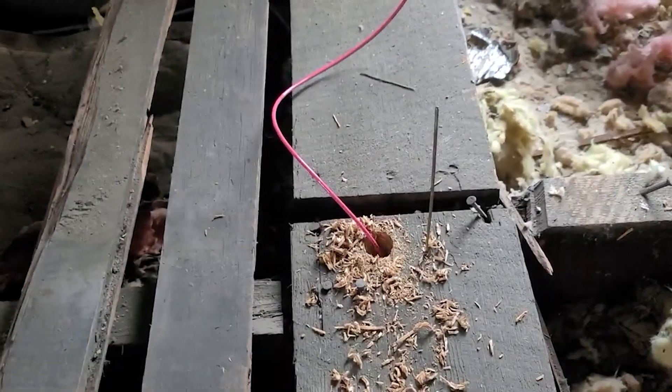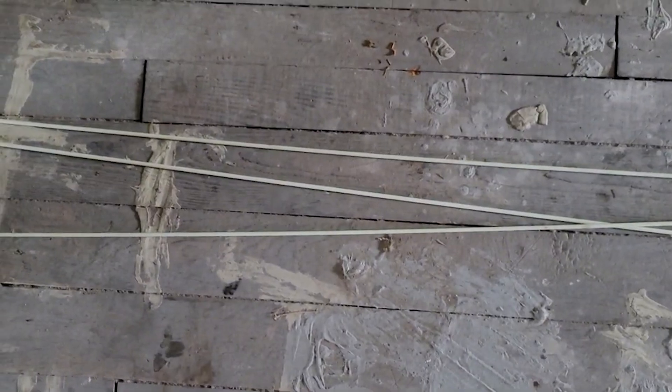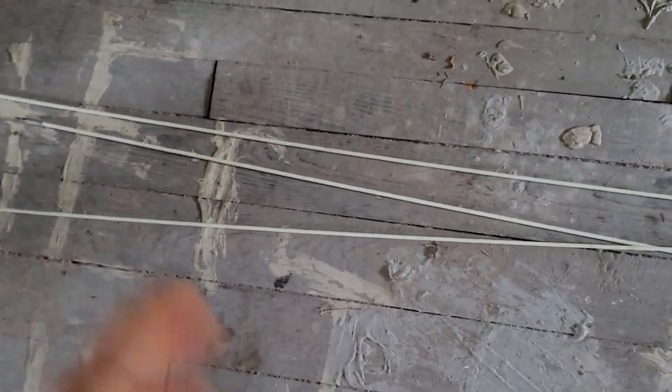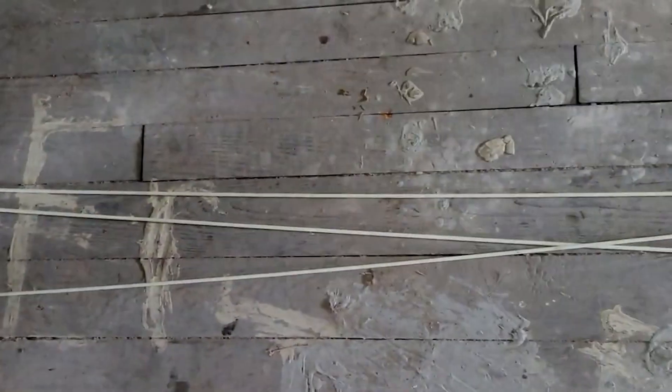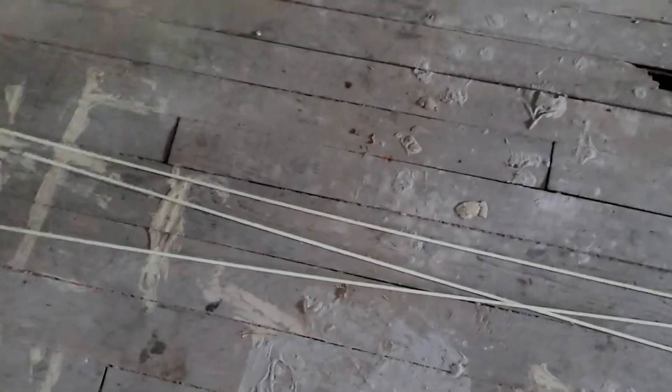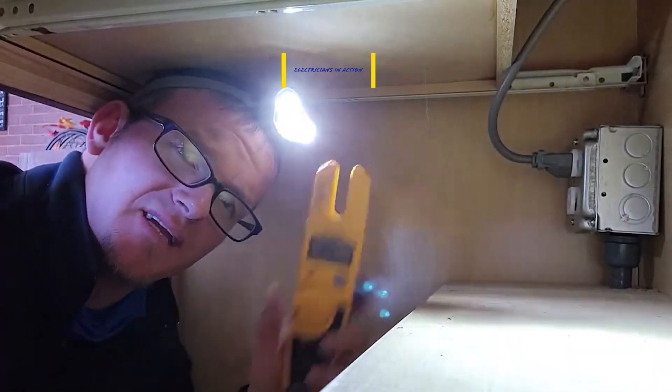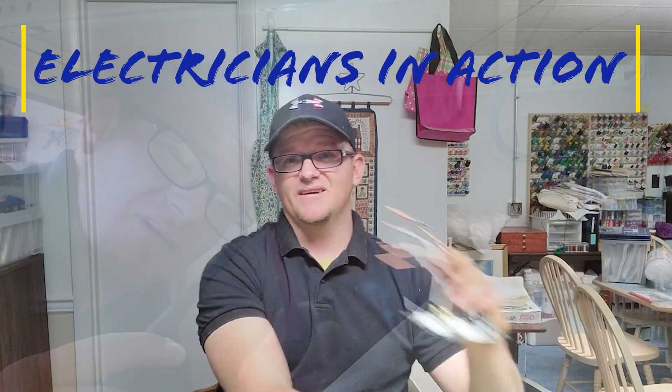So these are what the glow rods look like — they're just fish sticks and they literally screw together on the end. Because of the height of the ceiling, we end up screwing all three of them together and shove it down that hole we drilled. Someone goes downstairs, sticks their hand in, pulls it out, tapes the wire on, we pull the wire up, then we move on to the next location. That's your pro tip of the day!